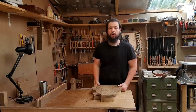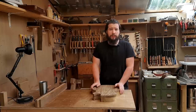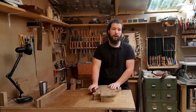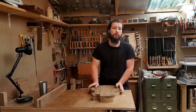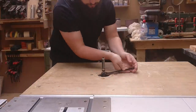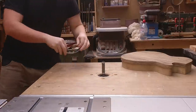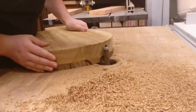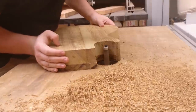I've moved the oak and maple veneer glue up to the side. I swapped out all the planes for clamps, and I'm going to leave that overnight so I can get on with flush cutting the horse chestnut top to match the green heart back of the body. To do that we need to go over to the router table, using the four-flute double bearing cutter from Radian Tools, which is an absolutely beautiful piece of kit — and absolutely terrifying. This one is well used; it's been through the wars, but there's a bit of life left in it.